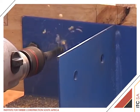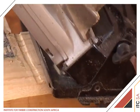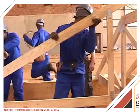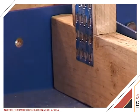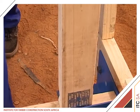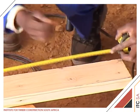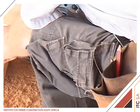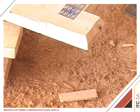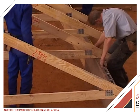A tip worth noting: the J1 truss which is supported on the heavy duty bracket is chamfered vertically to allow for the thickness of the weld down the vertical corner of the bracket, so the J1 will fit firmly against the face of the bracket. The ends of the bottom cords are now trimmed to the correct length and the hip girder cut to 45 degrees and placed into position firmly against the girder.